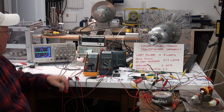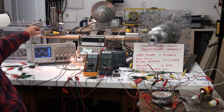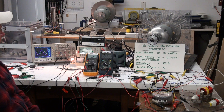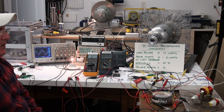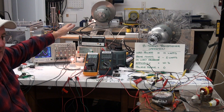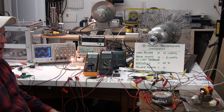Let's go over one more time. 283 watts to the prime mover, 12 watts to the load — and a 2-watt decrease to the prime mover. The generator is delivering reactive power to the bi-toroid transformer primary. The generator is acting as if it's still on no-load, while the secondary coils of the bi-toroid transformer deliver real power to the load.